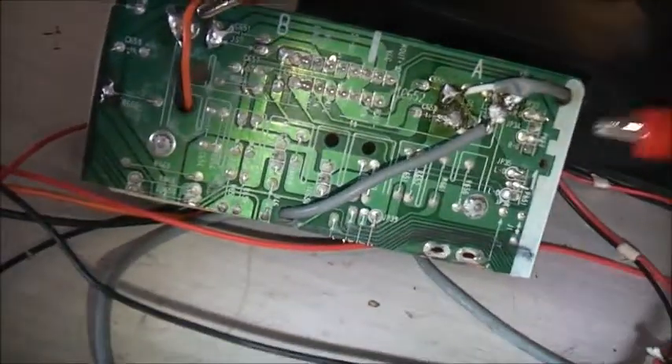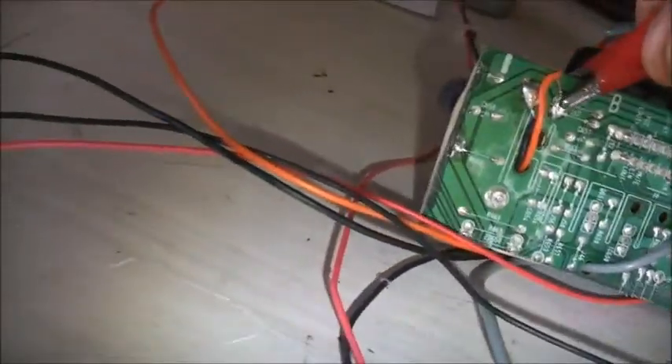I'll try and hold it and do some balance adjustments. So I'm going to turn the volume down on the receiver. I'll try and get a hold on this if I can — but hitting the heatsink and shorting it. But it is working. One channel's hooked up so I can't get the left channel to work unless I touch on that input. I'm just going to change how the circuit boards line up, I think. Because I did triple check, and according to those pinouts and where the wires are going, that's wired up the correct way. So one of these components must be going somewhere it shouldn't for how I've set the circuit up.